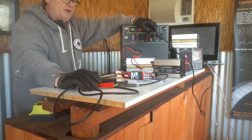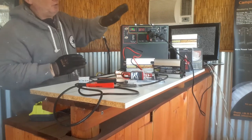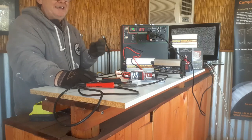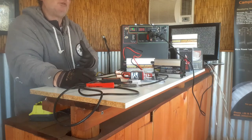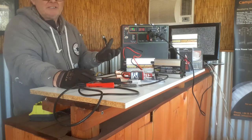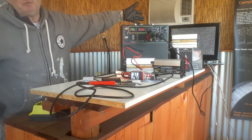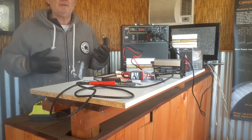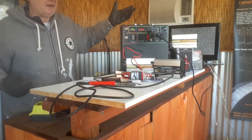These are modified wave inverters. Modified wave means the waveform is stepped, whereas pure sine is a smooth curve. Pure sine inverters are much more expensive and provide cleaner power — like what you have in your house from the AC grid. Modified wave inverters are better suited for rougher power use: power tools, Dremels, soldering irons, and small TVs. If you want to be precise about it, you should use pure sine for anything of value, as modified wave might shorten its lifespan slightly.